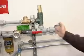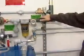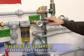This is the pipe coming from the intermediate tank outside, so this is where the fuel supply comes into the day tank. It comes through a valve that is labeled normally open. You would only close this valve if you need to change the filter or service something in here. Otherwise this is always open to keep your fuel supply on.